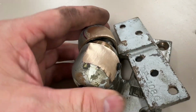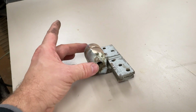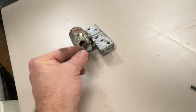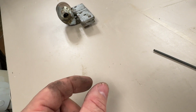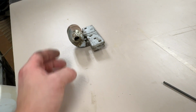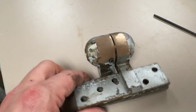Now, why I have these cuff marks on it is because it's rubbing the door right there, because these hinges obviously only work when the center point of this rotation lines up exactly with the center point of the rotation at the top hinge, goes through the middle hinge, and lines up with the bottom hinge or bottom pivot on the floor. And the one on the floor is out by about 5 millimeters. So that's why between the top and the middle, 2 points always define a straight line, but the third point has to be also on the same line, which it isn't, so it needed a little bit of sanding. So that's what's involved.